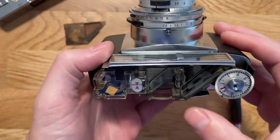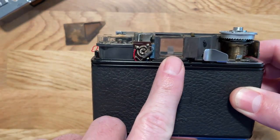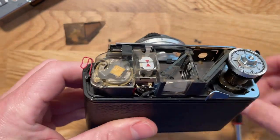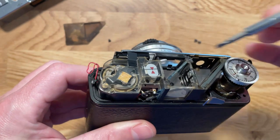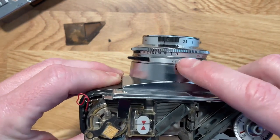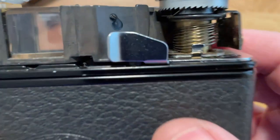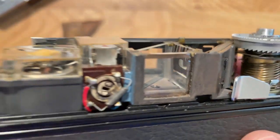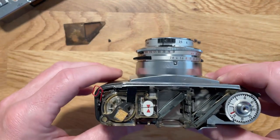The light that comes in through the viewfinder passes through this diagonal piece of glass and out through what you look at. But in front of it, you can make out there's just a little teeny mini lens right there. Just a little teeny chunk of glass. And that little chunk of glass is allowing you to see your shutter speed and your aperture reading. And that pops up in your viewfinder. So it's pretty interesting. I don't know if I can get it right here. Not gonna focus right, but that little square of glass is actually allowing you to read this through the viewfinder. You can always read it from the top, of course, as well as the light meter, but it allows you to view it through the viewfinder.